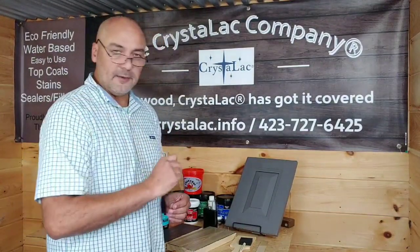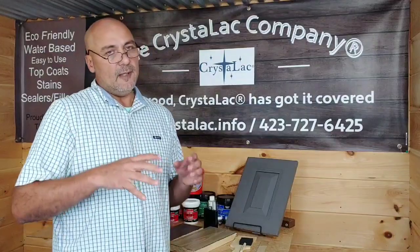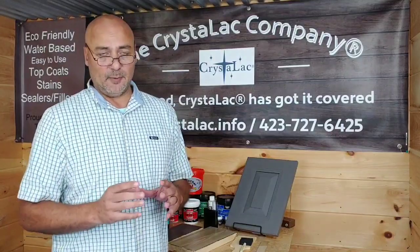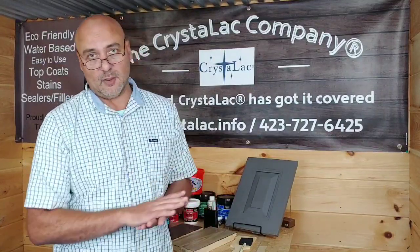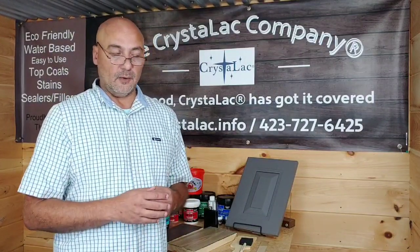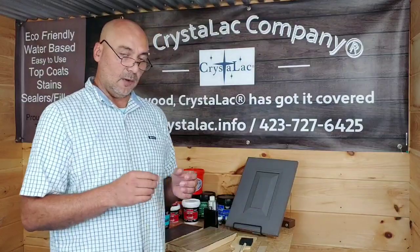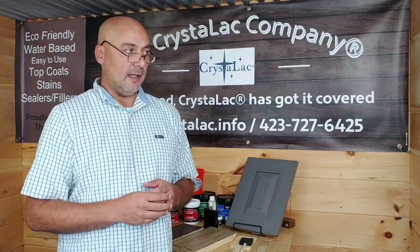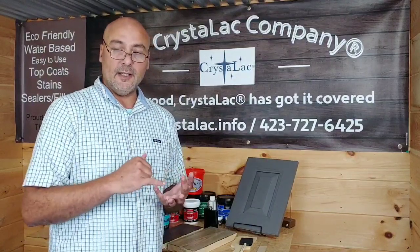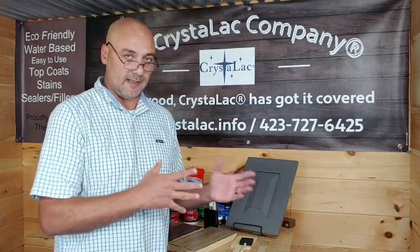Whether you're going over stained, raw wood, painted, pre-finished, whatever — you've got to stick to the basics. Number one, if you're going over any kind of project, you want to prep. With raw wood, you want to sand and perhaps do a sanding sealer to help bind the pores and grains to avoid grain raise. For a pre-painted or pre-finished piece that's been done for years, you want to clean, scuff, and clean again before you prime and go on to your top coats.